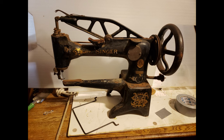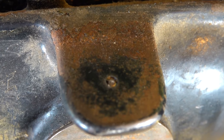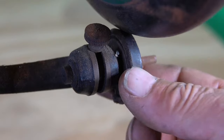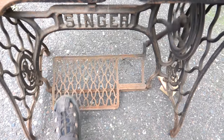When it was dropped into the dumpster, parts of it were broken, such as the zipper foot, the foot lifter lever, and the rod that holds the thread spool, along with a few bolts. The tire on the bobbin winder drive was shot. The drive belt was missing. Many parts are very rusty, like the thread waxing tanks, the moving parts, and the entire treadle assembly. The good news is that the treadle still worked.